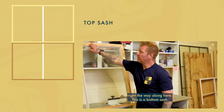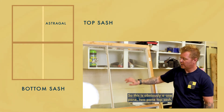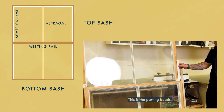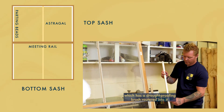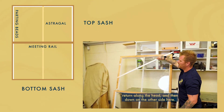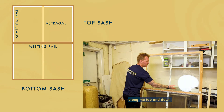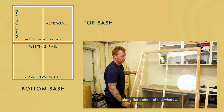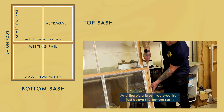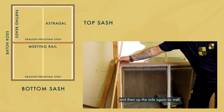This is the top sash, this is the bottom sash, and this is the astragal on the window — a one-pane and two-pane top sash, and a one-pane and two-pane bottom sash, with the astragal along the middle. This is the meeting rail. These are the parting beads which we install onto the windows, which have a draft proofing brush routered into them. They go all the way along the top sash, return along the head, and back down the other side. There is also a router draft proofing brush along the middle and along the bottom of the window. These are called batten rods — they sit on the window with a brush routered from just above the bottom sash right down, and an extra one along the ground and up the side, also with a draft proofing brush routered in.